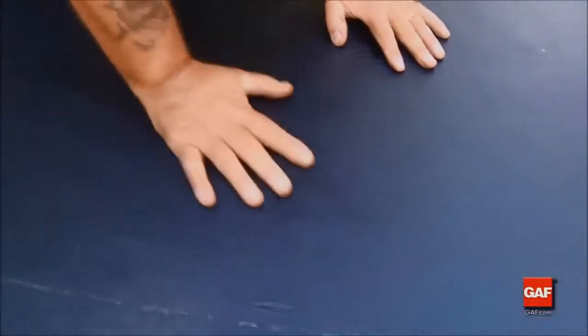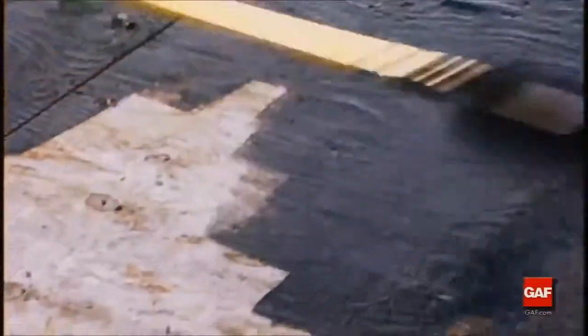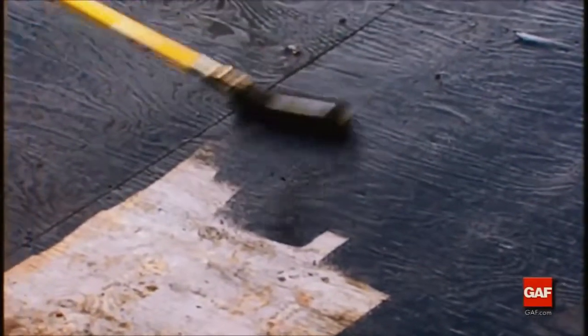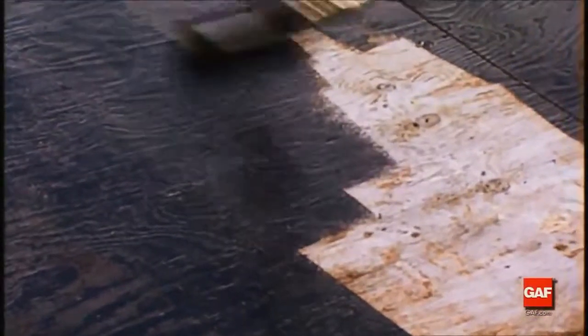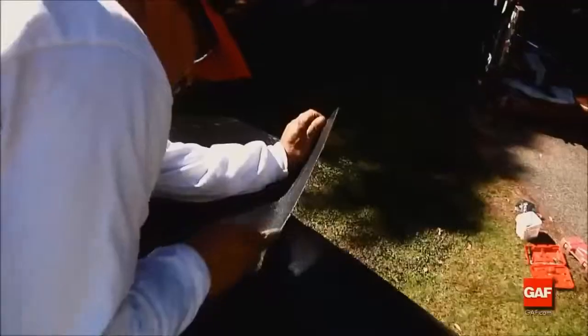While the adhesion to wood is good without primer, the best long-term adhesion is achieved when the wood is lightly primed with 1 coat of Matrix 307 asphalt concrete primer or a comparable ASTM D41 type primer. Remember to allow the primer to dry completely prior to the installation of the Liberty self-adhering base sheet. Over-application of primer or application of the membrane over wet primer may cause the roof to blister.